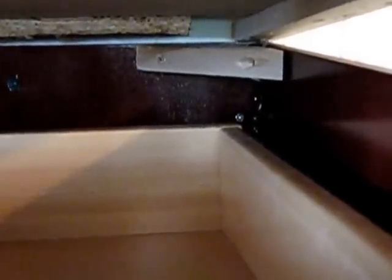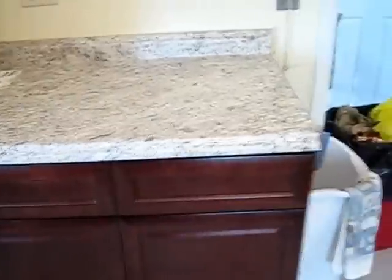Okay, the finished countertop, once it's done, and to connect it from the underside, you'll see wood crosses or plastic crosses. Usually 1.5 inches, 1.25 inch screw up through that into the countertop. There's usually more than enough to secure it. And you always want to have somebody pressing downward here as you're screwing up inside. Take both drawers out. Relatively simple, a little dark in there to show you by video, but that's your end product with your finished out end.